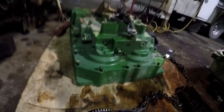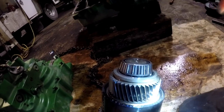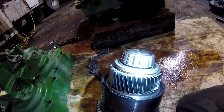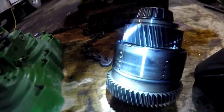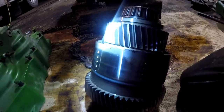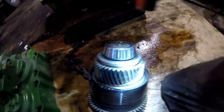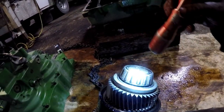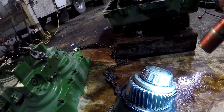I'm trying to see evidence of burnt. Now I'm kind of seeing heat checks. See the heat checks in the side of the drum? This particular one that slipped - as expensive as it may be and as much money as it may cost - it's still better off. We'll probably end up changing the whole drum out because I don't want to take any chances with a cracked drum. So I need to get this bearing off here and get her pressed off, and we'll go from there.